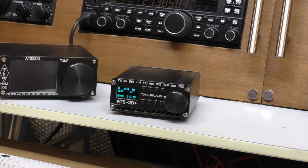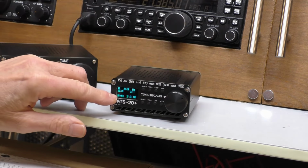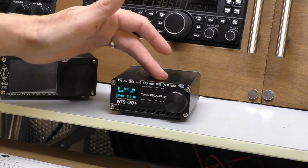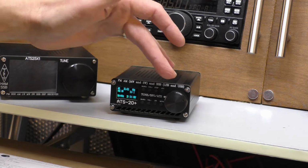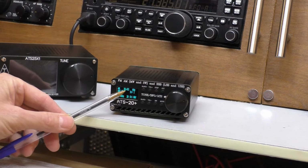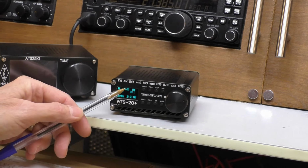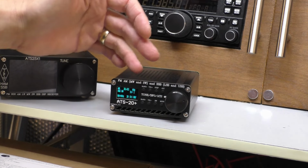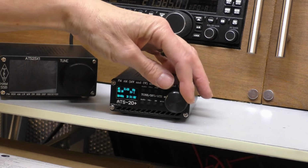Also, when it comes down to sideband performance, it's quite good that you just push in the encoder and then you go to the BFO, or clarifier if you like, and then you can fine adjust the stations. But when you're on the AM, on the shortwave band, I think they could have used that function that if you clicked it, then you could simply jump on the digits here. So if you click it once, you would adjust the 1 kHz, then the 10 kHz, then the 100 kHz, and so on and so forth. That's normally how a radio tunes, and that way you can get to your desired frequency a lot quicker.